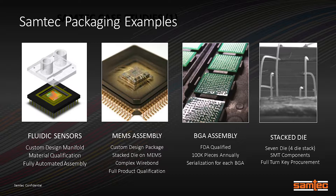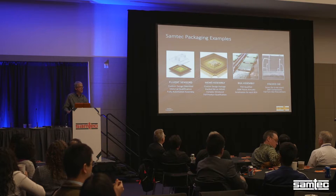We also deal with standard ball grid array technology—BGA, because we love acronyms as engineers. And then there's stacked die, which is quite impressive because stacked die are not done outside of memory technology. In this case it's a mixed, heterogeneous, integrated technology. The current term is heterogeneous integration, and we've been doing this over the past five years.